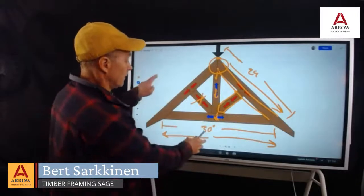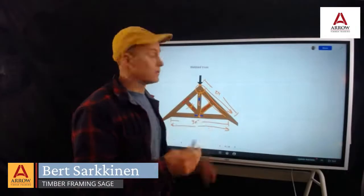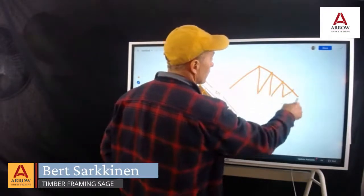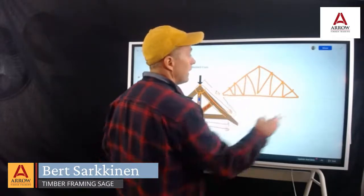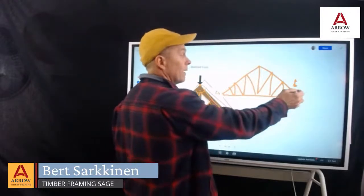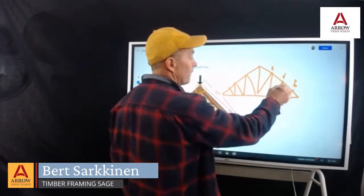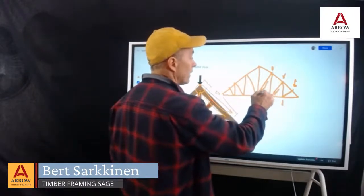In, say, a 60-foot span truss with 2x4 members, you'll see a truss that maybe looks something like this, with a lot of webs, like so. And what's happening is this 2x4 can't make that span. So we get forces pushing down, pushing down, and again, it's pulling. So then each one magnifies, and it's a chain reaction. We pull, and we keep pulling down.